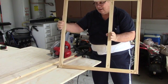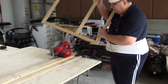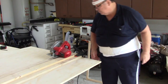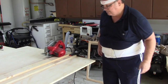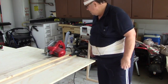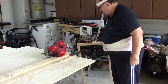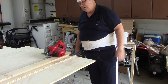I have taken the back side and routed out the grooves that need to be in it. Where there are no grooves and I need to put a board, I'll be using pocket hole screws. What I've set up for here is to cut my first side — 36 inches tall by 20.5 inches wide. You take your 3/4-inch face frame, deduct the 1/4 inch off that, so that's a half inch. So if I cut this 20.5 inches, and add the half inch of the frame, that will give me my 21-inch depth that I'm looking for.